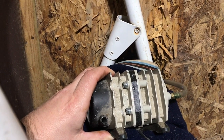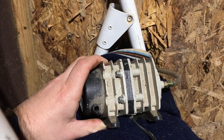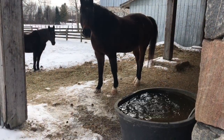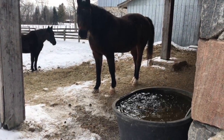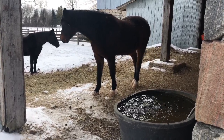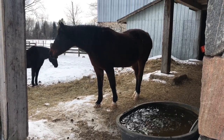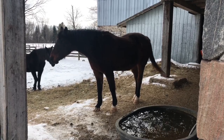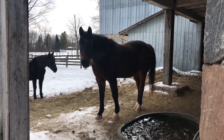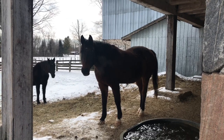This has just worked out great for us and hopefully it works well for you as well. If you are interested in this, I will leave a link in the description down below so you can check one out for yourself. As you can see, the horses get used to the bubbling of the water and you don't have to worry about any shock hazards with the bubbler going. The one thing you have to make sure when you use an aquarium bubbler is that you keep it above the height of the water trough, so that if you have an outage the water doesn't siphon back into it and cause an electrical problem when the power comes back on.